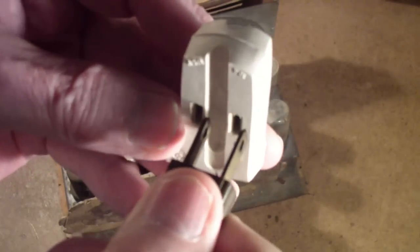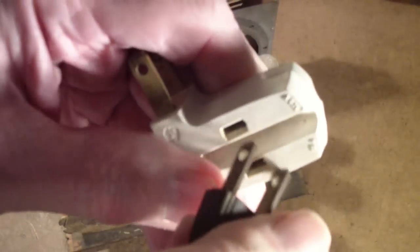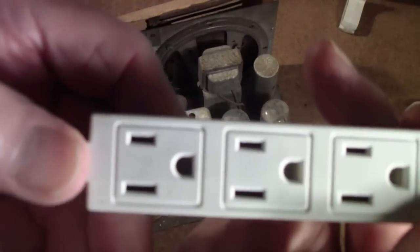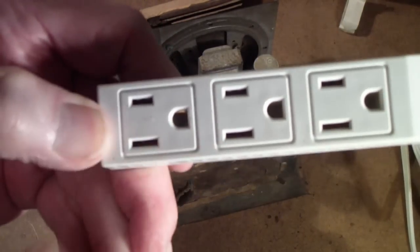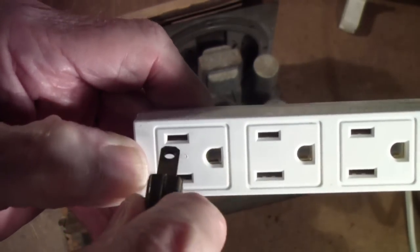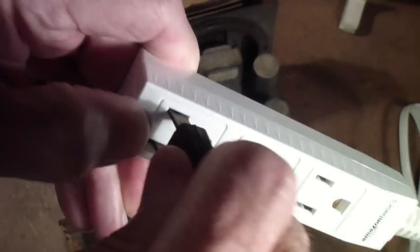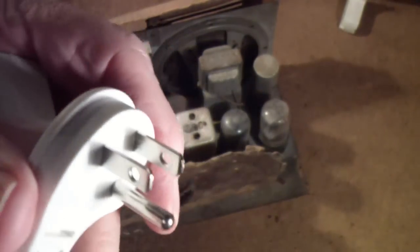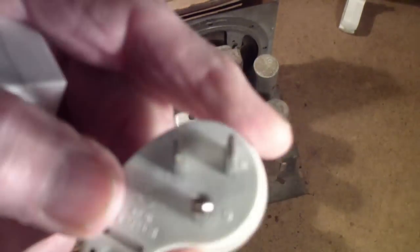Plugs of the day were like this — they had two identical connectors, so you could plug this in one way or reversed, and they didn't have a ground lead. Both sides were the same size. Today, because we have learned better, plugs have a ground lead — they're called three-wire — and you'll notice that one of the spades is bigger than the other.